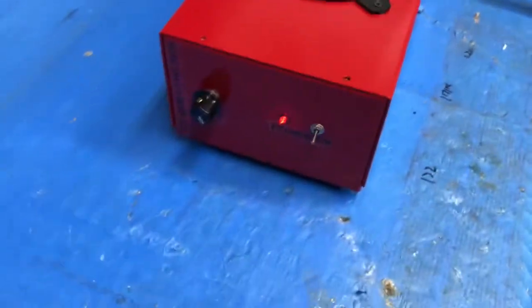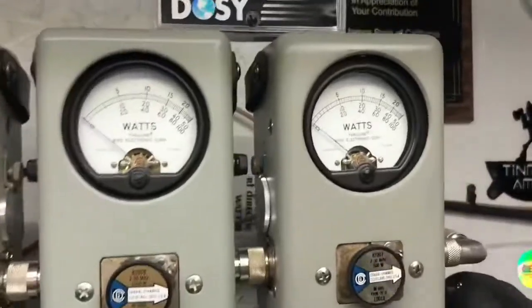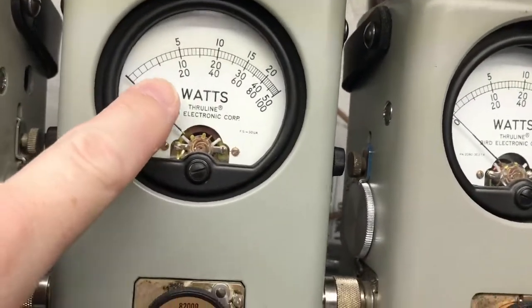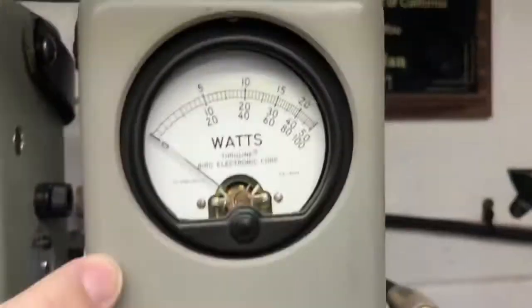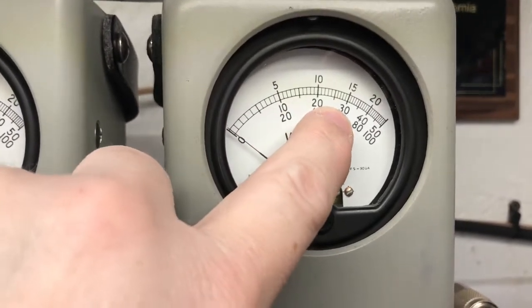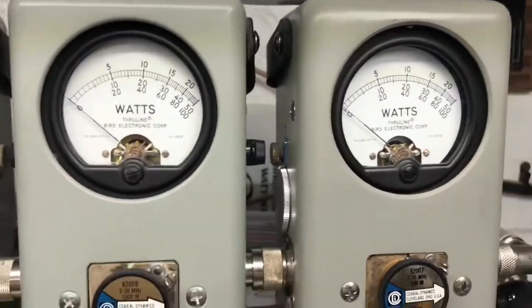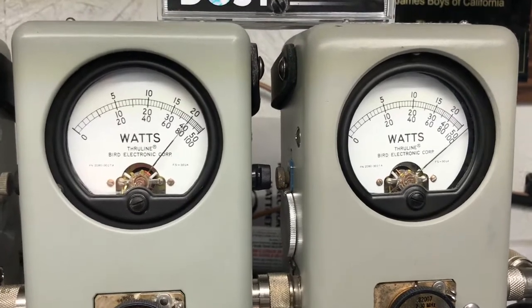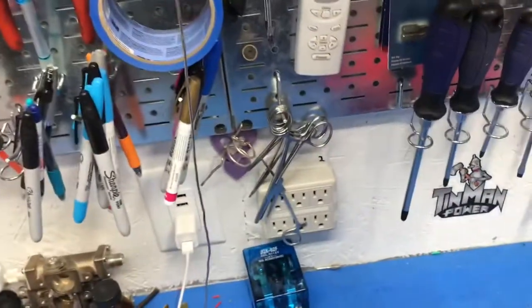All right, let's get down with the show and do a little testing. I'm going to power the amplifier on. I love the new grills — they're just awesome. First key-up: thousand watts in peak — 200, 400, 600, 800, a thousand. That's 500 in average. Reading middle scale: 100, 200, 300, 400, 500. This is a 1x4 — well over 800.